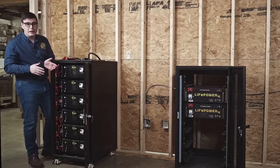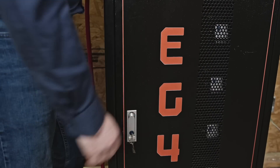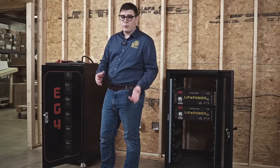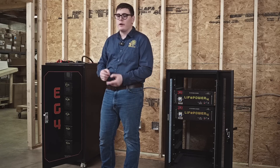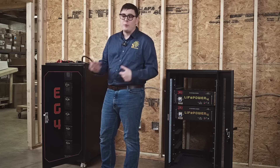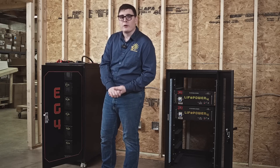This is a battery bank — it has high amperage. When you're done with these safety practices, you can always shut the door, lock it, and keep the rest of your family and friends safe. We've had customers with rivnuts and general bus bar strip-outs occurring. We always give people the benefit of the doubt if they say they used the torque wrench, but we just ask that people actually do use them and stick with the torque specifications. It's a hassle for everyone to be shipping bus bars back and forth.